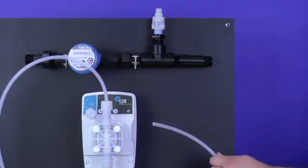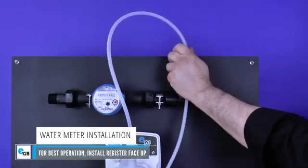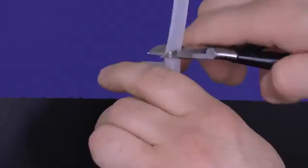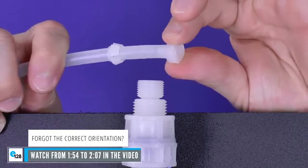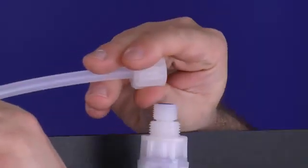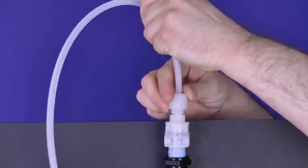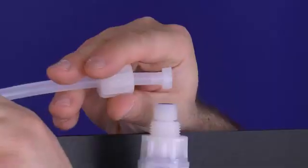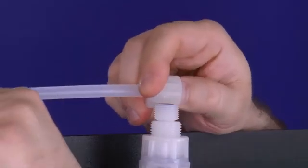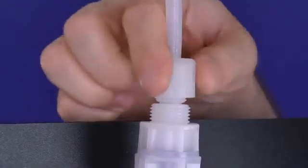Grab the rigid polyethylene discharge tube connected to the discharge valve. Using diagonal pliers or cutters, cut the tube so that it runs comfortably from the discharge valve to the injection valve. If the tubing is too snug, the tubing connection will come loose and produce a leak. Reattach the tube connections onto the loose end of the discharge tubing, being mindful of orientation. Pull the tube nut toward the nozzle to compress the collar and nozzle tight together, forming a ferrule connection. Attach the tube and connections onto the injection valve by hand tightening the tube nut. Do not cross-thread nor over-tighten. If the tube nut is not securing, recheck the ferrule connection, then retighten until secure.